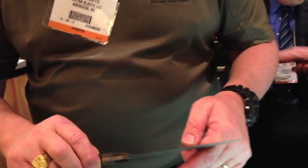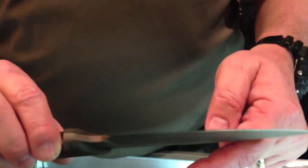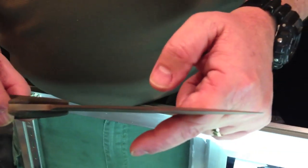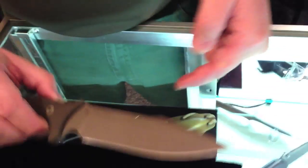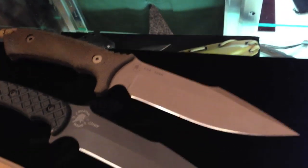As a knife maker, we take these advancements in steel and use them to help us in our design so it serves the customer better. Not that we ever sold knives that weren't sharp, but if you bought a knife a few years ago and you have another one now, it may come from the factory just a little bit sharper than you remember. A lot of that has to do with the way we sharpen them based on the toughness of this steel. All our knives are double deep cryoed — it's what's prescribed by Crucible, the manufacturer of the steel, and it makes for better edge retention and a longer-lasting knife.